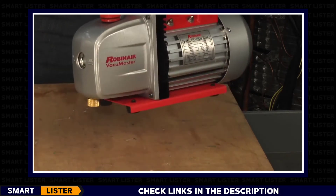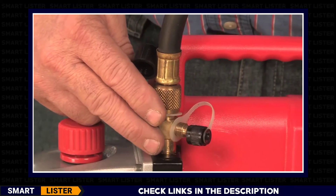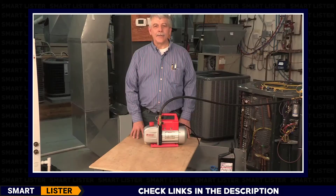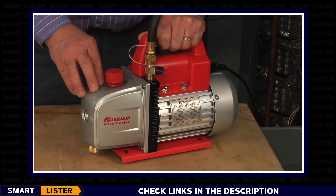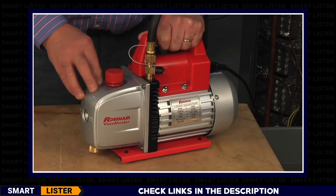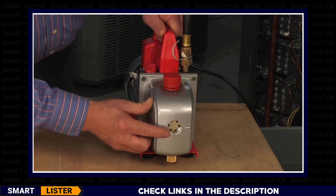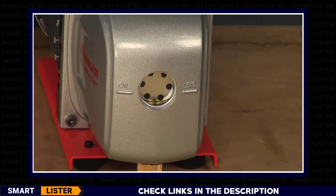It's much lighter than the other 28 to 30 pound pumps you'll find in the field. The multi-port brass intake valve is equipped with quarter, three-eighths, and half-inch fittings. Easily accessible oil fill and drain ports allow for fast and complete oil changes. The easy-view oversized sight glass is key to verifying your oil is clean and the level is correct for proper pump operation.